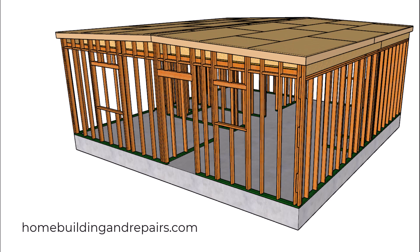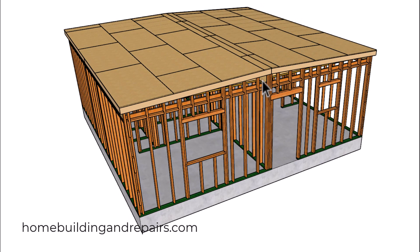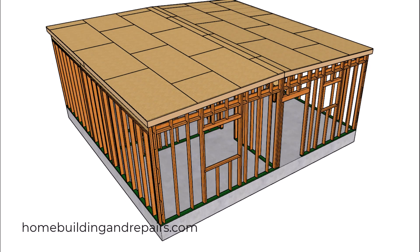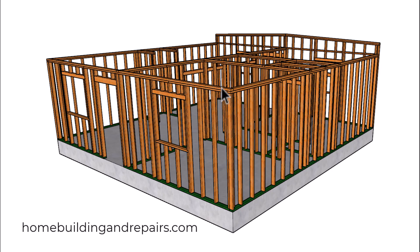Here is another one of our 625 square foot house roofs and it's going to have about a half inch per foot slope, or about a 0.5 and 12. I went ahead and extended the roof framing on this side to provide one example of how to build it, and then installed a rim joist on the other side to provide another example. Even though one is going to be a little stronger, I don't think you would ever have a problem with that method.